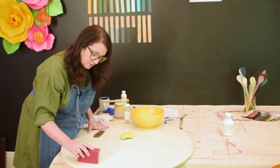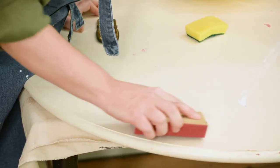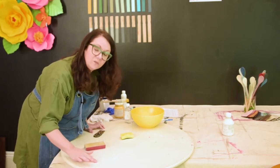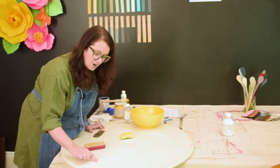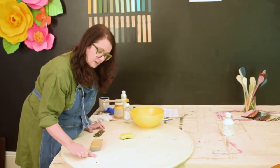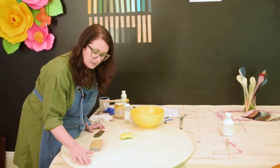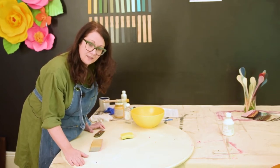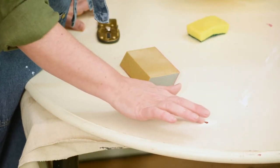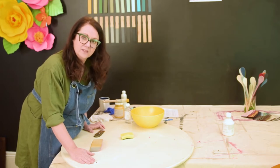This spot isn't coming off with a scraper — it was probably just a ding — so I'll smooth sand and feather it out until I can't feel any ridge. If there's a big area where paint has chipped off and you can feel scarring in the wood with your fingertips, you'll see it when you paint. Go in with a wood filler, fill it in, smooth sand it. Do not trust your eyes — they will lie to you every time. Feel with your fingers, and if there's a dip, sure enough, you'll see it when you paint.